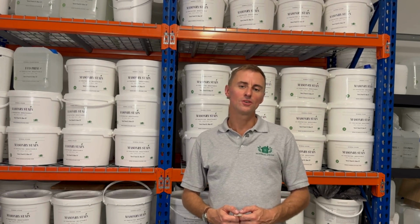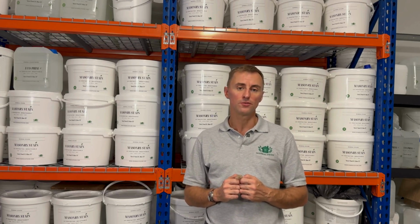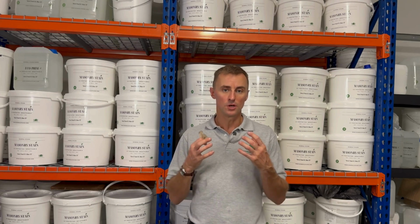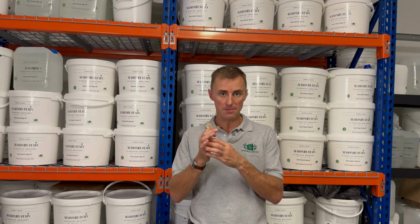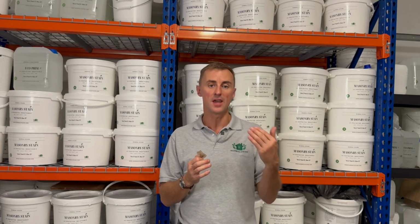In conclusion to using our mineral stains, I have a few key takeaway points. You want to give yourself at least 12 to 24 hours when applying before you go ahead and use our masonry stain. Let the primer do its course, solidify, and crystallize within the brick membrane or mortar, and then you'll see a world of difference the next day or the day after.